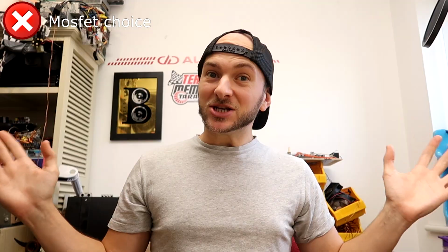When I mentioned this to the engineers at Taramps, they said that they were working on finding a better output MOSFET for the base model that retains the same current capabilities of the 150 volt FETs it's got in it now, but with a higher breakdown voltage. So hopefully this will be implemented, since as it stands, I predict some people having some random failures with the base version as a result of this. I may be proven wrong though, especially if the IRFB4115s here are spec'd up with some voltage headroom above where they're officially rated on the datasheet.